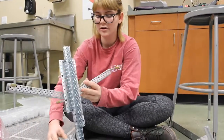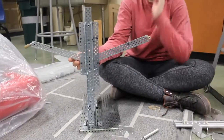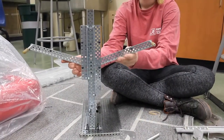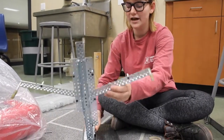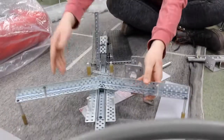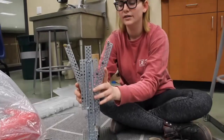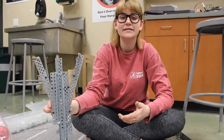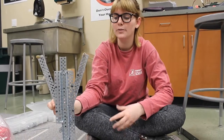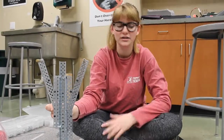This is just a quick model we designed for our next iteration. Basically, it's going to have a piston that actuates it down, then pistons that pull it together to grab the gear, and then pull up. It makes it a lot easier to accurately and consistently grab gears, and also place them in a much quicker and more efficient fashion.